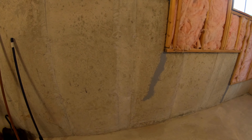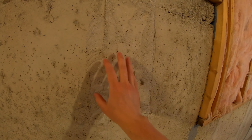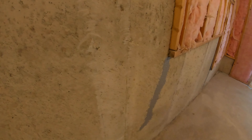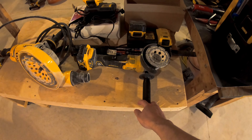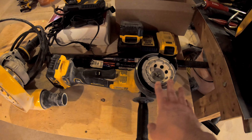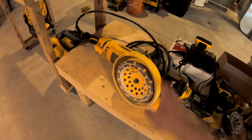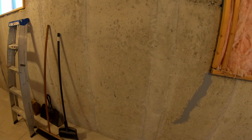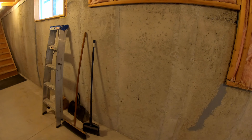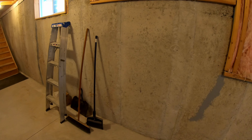To prepare for the foam board, I've had to grind parts of the foundation. This is a poured concrete foundation, and at every gap in the forms there's going to be a bit of a ridge. So I took a grinder and actually smoothed out most of the foundation wall. This is primarily the grinder I used — it's just a four inch diamond wheel on a cordless grinder, and it worked pretty well. It actually bites really fast into the concrete and was able to remove it quickly. The thing about grinding concrete inside though is it's a terrible mess — most of that just turns into dust and gets into the air. I was wearing a respirator, but the entire basement was cloudy. I had exhaust fans running and there's only so much you could do. Half the time was spent grinding, the other half the time was spent cleaning everything up out of the basement.